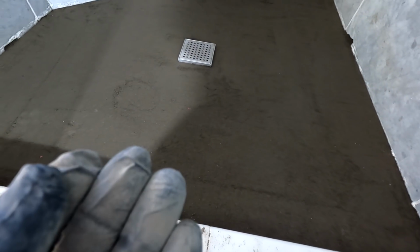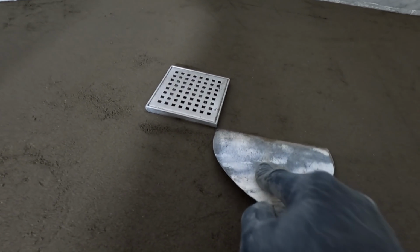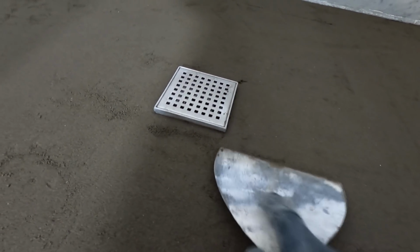I wanted the two to mesh and combine. And so this has a lot less water in it than the cement did. Therefore, my take on it is that this will leach up all that excess water into this at the same time it's trying to cure, and probably this surface will become a little more damp than it currently is, which is okay. I hope. No, it's okay. It'll work. I'm convinced of it. I've convinced myself anyway. I don't see any harm or foul, unless a mason is out there that could tell me otherwise.